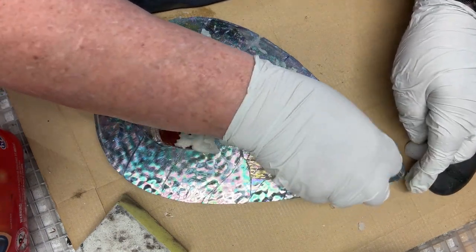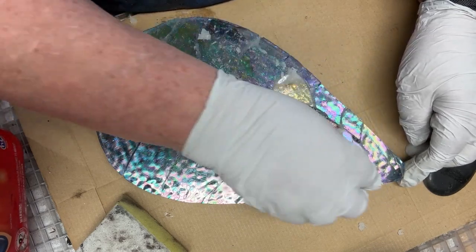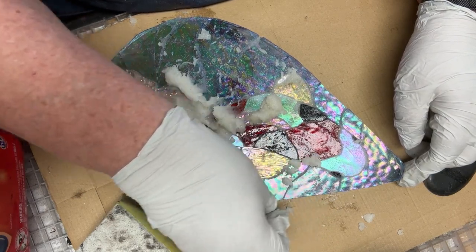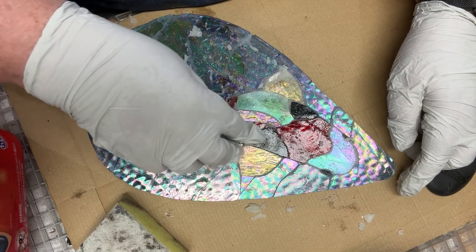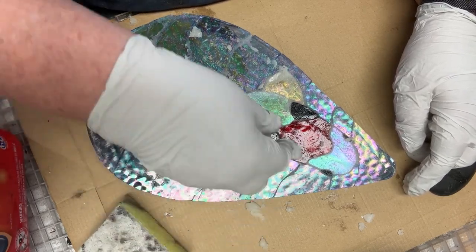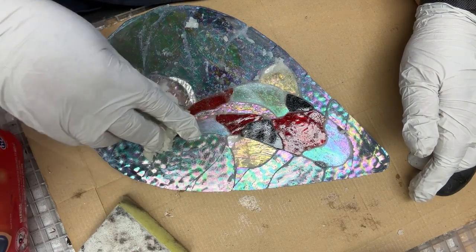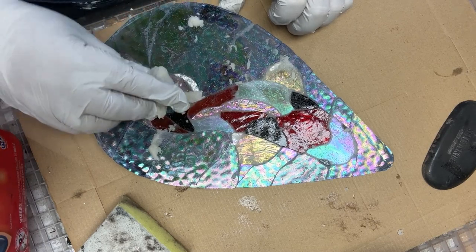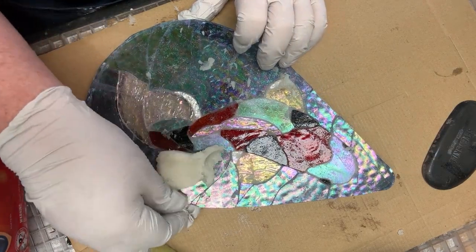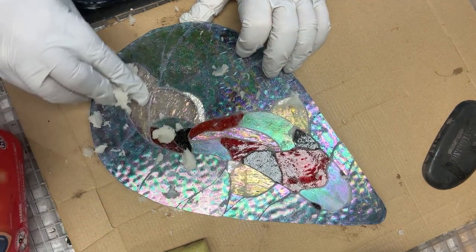Now it is very important to make sure that your gaps are filled, because if you notice gaps once you've started cleaning, you have to wait until the piece cures before you go back and fill those - it has to be dry before you add more grout, otherwise you can introduce a fault line. You can add more grout before you start cleaning, but I do recommend mixing less rather than more. I've mixed a fair bit because I have a large tub getting to the end of its life, but normally I suggest people err on the side of caution because it's not the cheapest product.